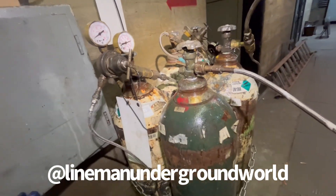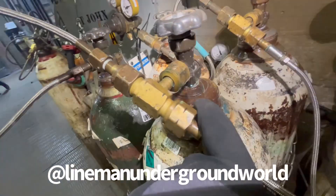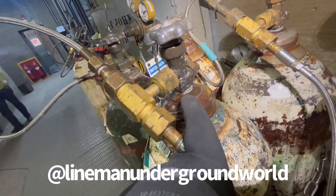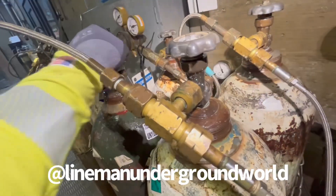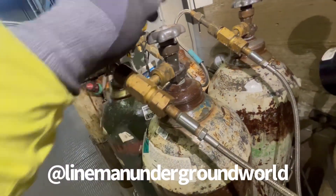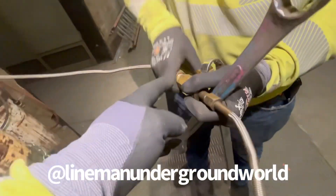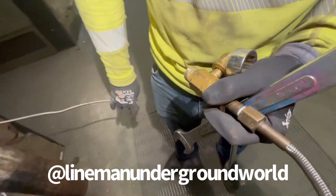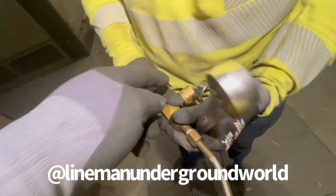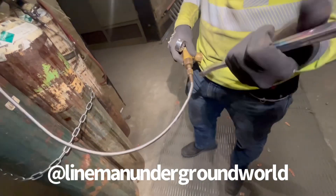If I don't see any leaks — here we go, she's bubbling up right here. So I'll turn off the gas again, release the pressure, and tighten it up. What happened is these things, after a while, get all stripped out on the nut, so we can't tighten it as much as we need to. We're going to have to change it out.